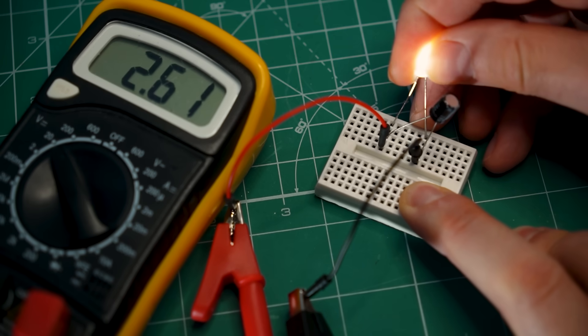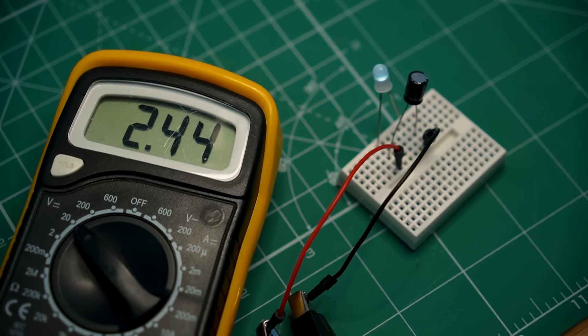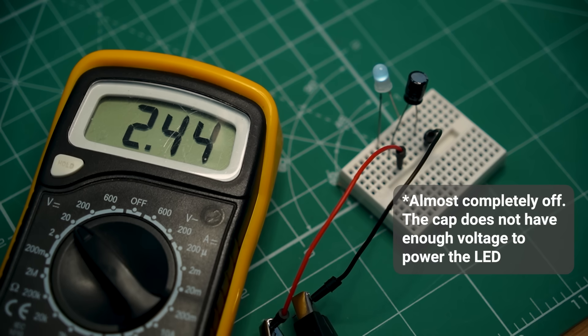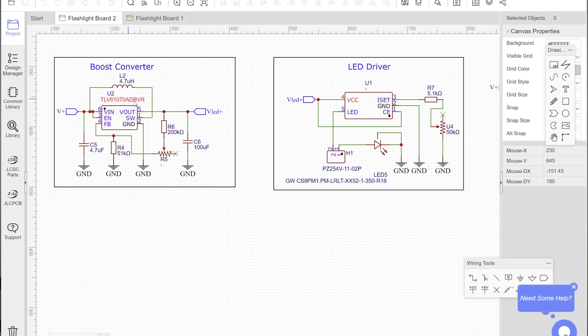The flashlight makes more than that, so we need something to keep that voltage under control. Then there's the issue of LED forward voltage — that is the voltage at which the LED starts conducting, and for white LEDs that is usually over 2.7V. That is why this small supercapacitor can barely keep this small LED on even though it is fully charged. After a few moments the LED is completely off, even though most of the energy is still in the supercapacitor. To solve these problems, I designed a circuit that charges the supercapacitor and boosts the voltage for the LED.